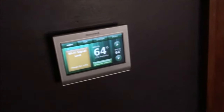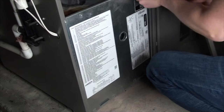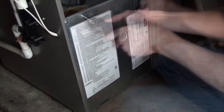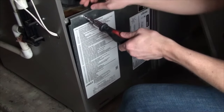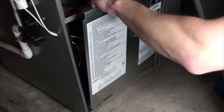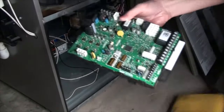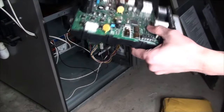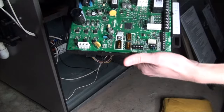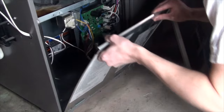I've included a bit of bonus footage for those of you whose motors and fans all work but after replacing that igniter you still don't get a light. The lower panel can be removed using that same quarter inch socket, but removing this panel will automatically engage a furnace kill switch for safety, so you won't be able to test it without depressing that safety button.